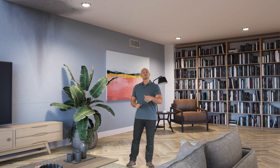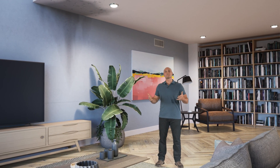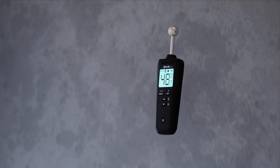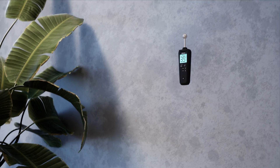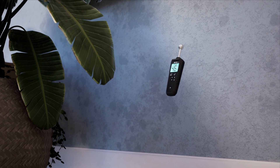On the walls you'll often find a top-down triangular shape formed as water spreads downwards. For this one we're going to use the pinless MR59, which features a ball probe that helps you cover a lot of ground really fast. Plus you don't have to worry about unnecessarily damaging the walls with pin marks.